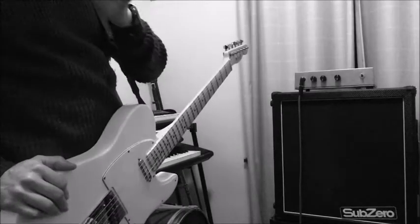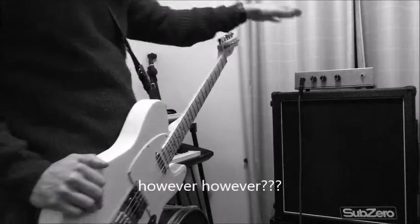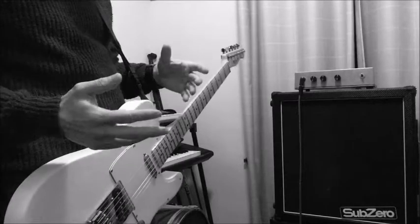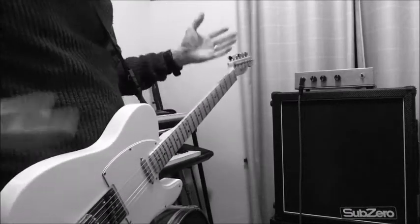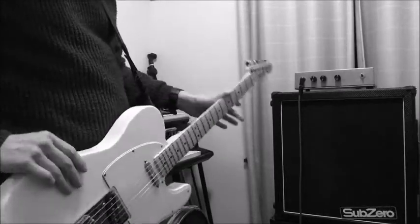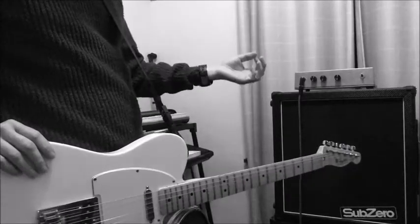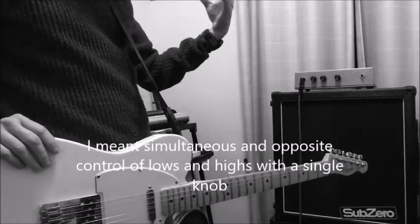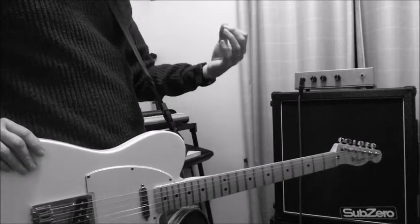The Tiny Terror shows that it can sound pretty good even when cranked. For this amplifier I didn't want too much gain because I don't use it that way, so I aimed for a Fender-like character — a broader bandwidth with fat lows and lower gain. Another interesting thing I took from the Tiny Terror is a single tone knob: turning one way enhances the lows and kills the highs, and the other way does the opposite, giving a fairly interesting range of tones with a single knob.